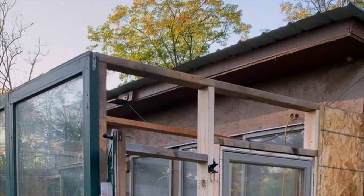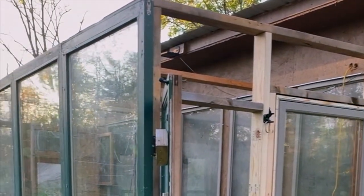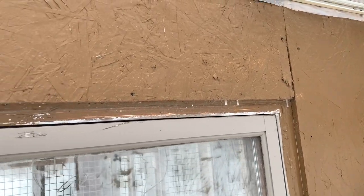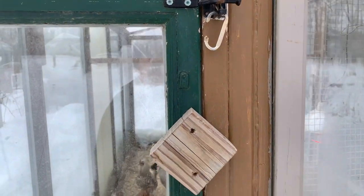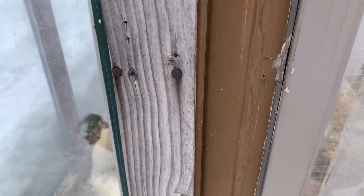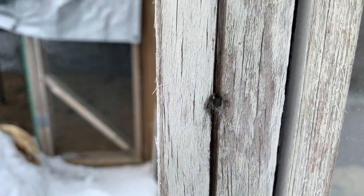You can just see there are a couple of new 2x4s, but most are old 2x4s from job sites — you can see nails that I sawzalled off. Just some basic framing, basically framing up those end walls. I sheeted it after everything was framed up. After that was all said and done, I primed it and put a good exterior paint on it. I even painted the exposed 2x4s, basically trying to get as much life out of that wood as possible.